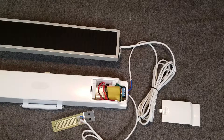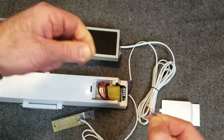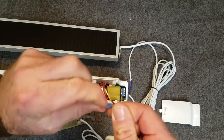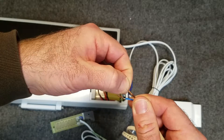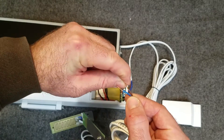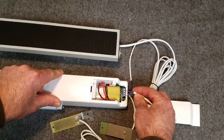The solar panel and rain sensor wiring will come with the wires pre-stripped just like so. All you really need to do is unpeel the excess wire casings, give the wires a twist, and maybe trim this down so you have no more than about a half inch of copper exposed. A tip we recommend is to take some solder and tin the end of these wires so that they become one solid piece. This will prevent any loose strands from accidentally going into the hole of the wrong terminal block, thus creating a short.